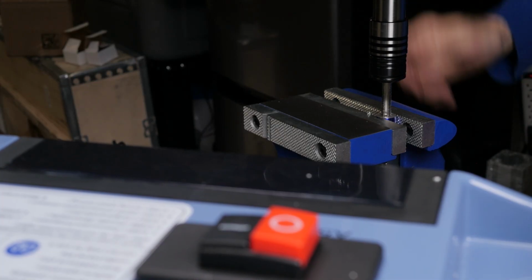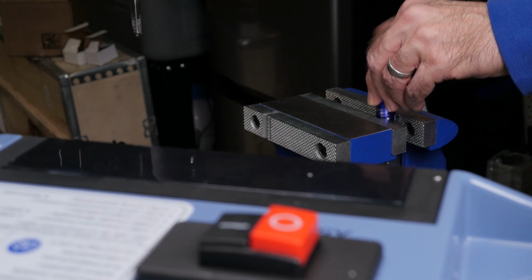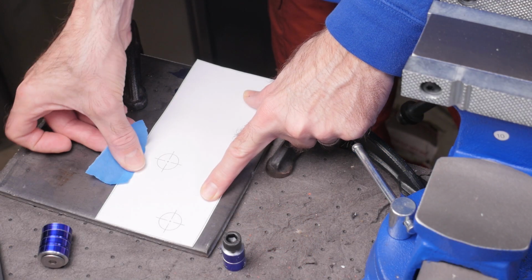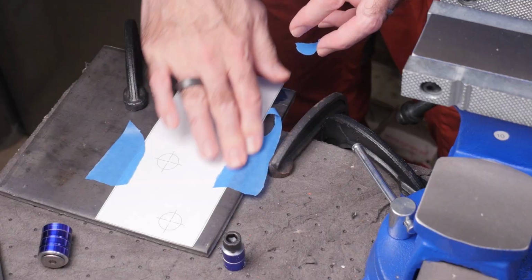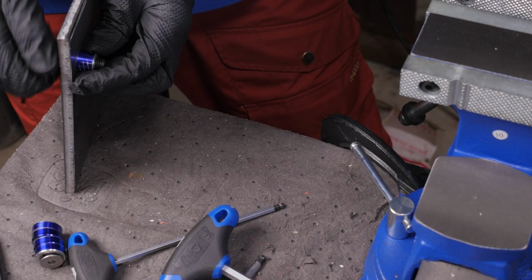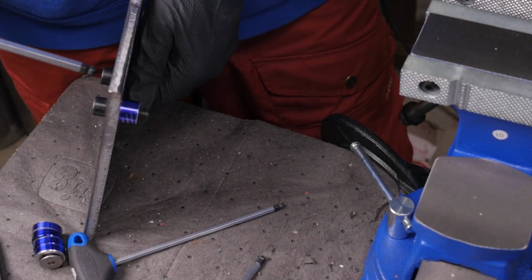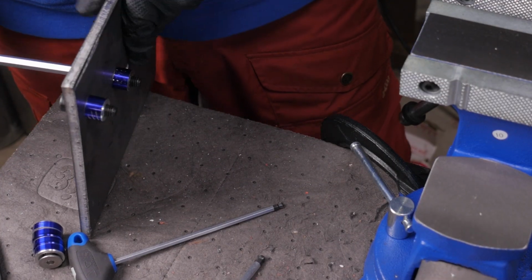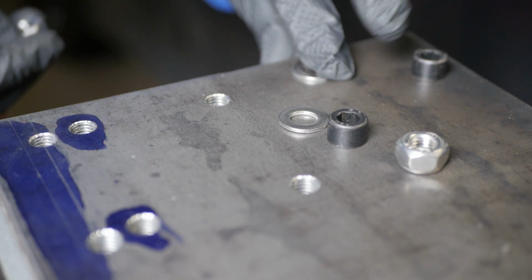The machine supplies a lot of torque, so make sure the parts are clamped securely. From Fusion, I printed out a template to mark the hole centers on the plate and drilled two 11mm clearance holes. I then inserted M10 bolts and snugged up the bushings on the bottom side. The assembly is then fitted into place on the pedestal and secured with some washers and locking nuts. It's also worth noting that I managed to mix up my drill markings, so I got some extra practice with the tapping machine.